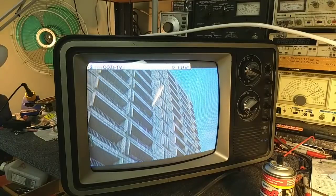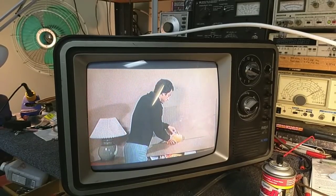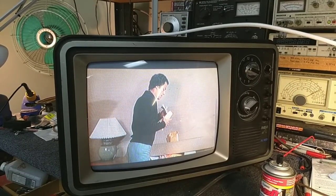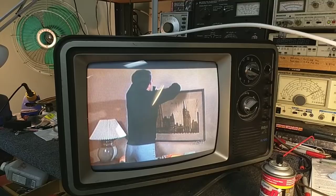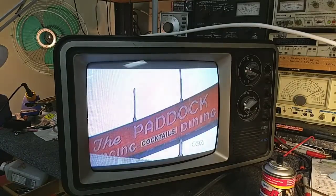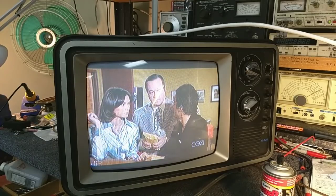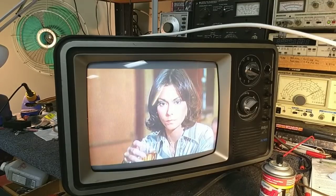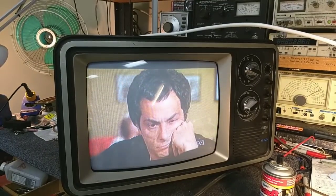So there you go — it's looking much nicer now. But if you're into collecting these things, don't be surprised if the CRT gets tired after years of constant use. This is 42 years old. Although it was a relatively low-hour set when I got it, using it adds to the age of its life. Its CRT was really tired, but thankfully the Beltran woke it back up, so I should be able to get some more years out of it before I need to start looking for a CRT again. Rejuvenation is hit or miss — it can last three months, or three to five years. It just really depends. And on occasion, like you saw, you get artifacts — little bits of the cathode that you blew off with the Beltran floating around and causing a momentary short. You just have to hope that it clears itself like this one did. Otherwise you actually did more harm than good, which you don't know until you rejuvenate it.